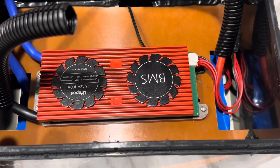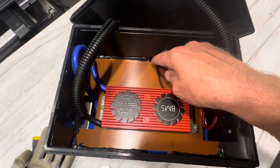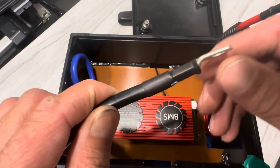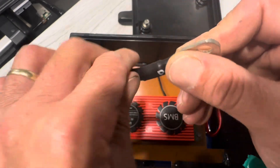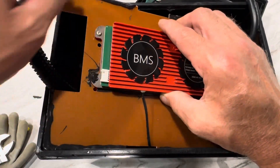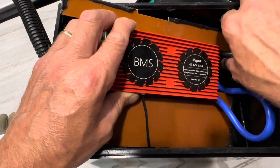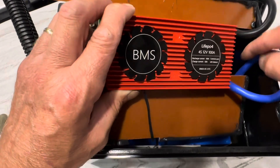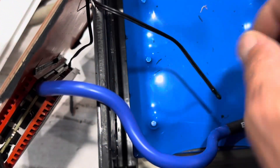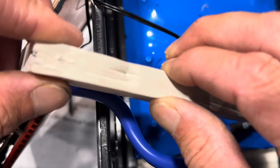But everything is assembled nicely. There's a temperature sensor right here. All the wire connections are hydraulically crimped, tin-coated copper wire. I've got it broke loose enough now that I can pull this covering off and get down to the low temp sensor and all that good stuff. Finally got the temp sensor out. I can't get those cells broke loose — they must have the snot glued out of them. There's where the temperature sensor sat in this super dense foam board.